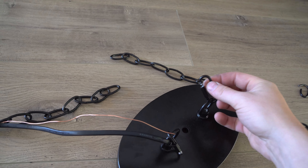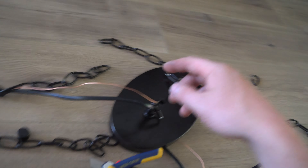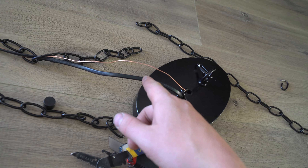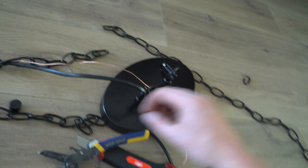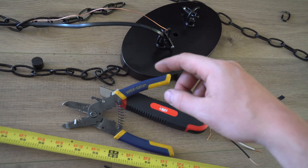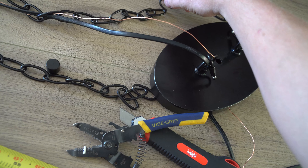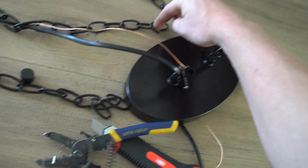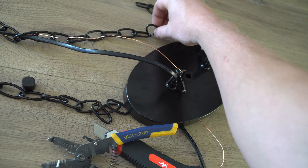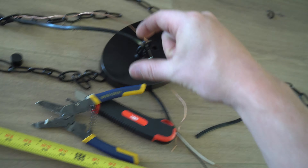As you can see, there's a hook right here. You're just going to open up the D-ring. That'll be on this side of the chain. We measured our old light and found out it was 64 inches. So stretch the chain out with the top attached. With this, add five inches for the shades on top of it. Once we measured for that, we then bent one hook right where we wanted it. The measurement came to here, so we bent this hook, took it off, and counted the links — or you put them side by side and count the links.